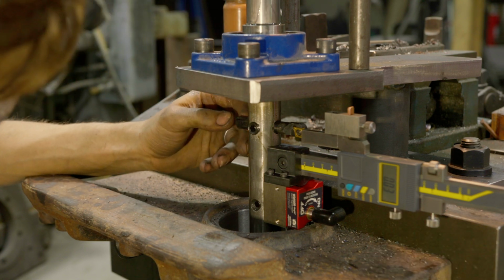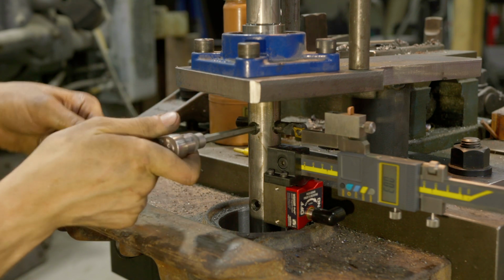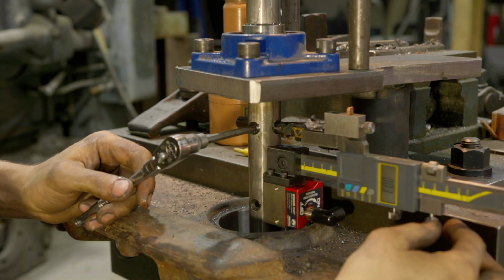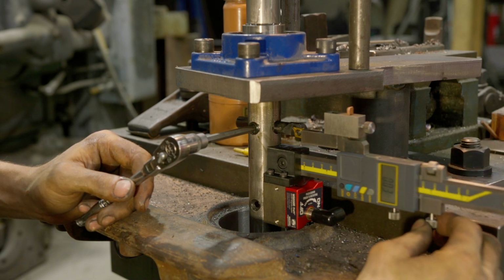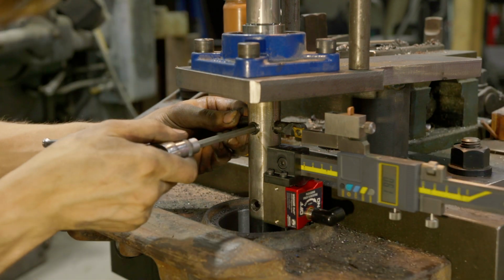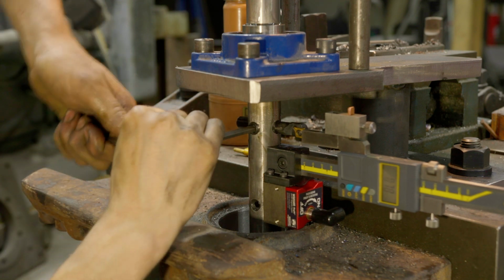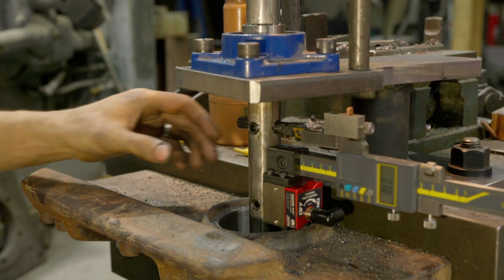And our bar looks like it was loose. Wow. We're going to advance it. I'm going to take another 60 thou per side. Slide my tool over. Either I forgot to tighten the insert, which is shameful, or it backed out. A little bit unlikely. All right, so we're taking 78 thousandths.